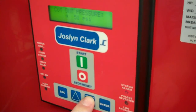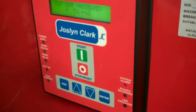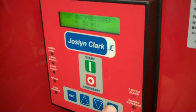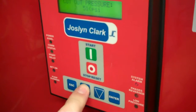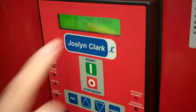Pressing the down arrow one time shows our cutout pressure is now 51 — it actually maintained the separation of cut in and cut out. Cut out is always above cut in. Let's change that to 55. Press the enter key; the display changes to show carets around the number. Up arrow to 55, press enter, and it's now stored.